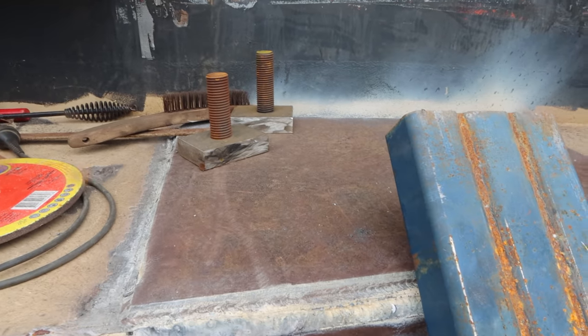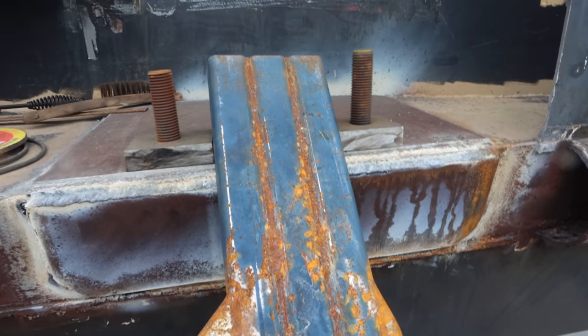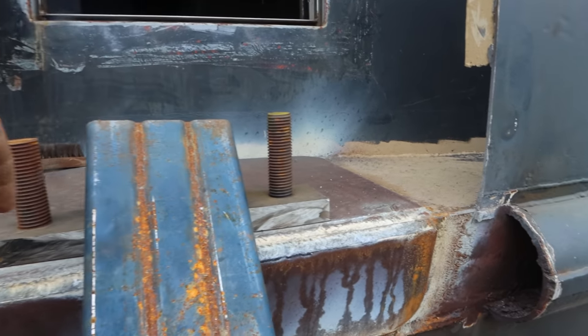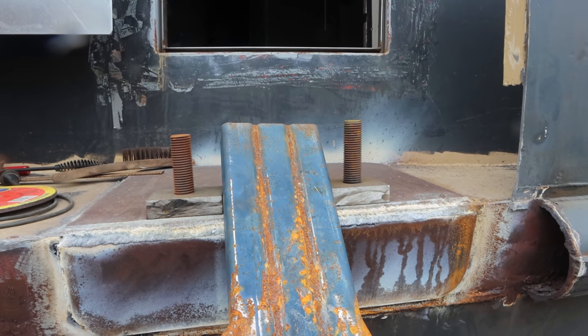Now that we've got the arms in place, we've got three of four sliders built. We're going to start putting them together, see if we can get them fit up onto the boat and get the geometry figured out. Now that we've got the top of the arm sitting where it needs to on the doubler, we know where to position these — we'll cut this off level, the 20mm plate will go down on top, with a 32mm hole for clearance, and the sliders sit either side of these stainless plates.